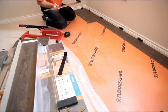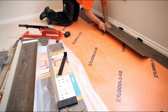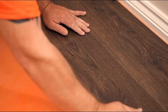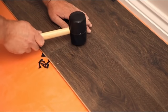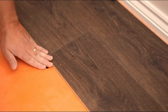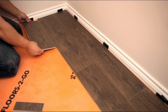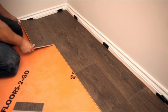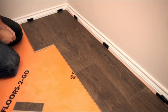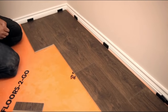Next, take a full length piece and put it at an angle into the corner between rows one and two. Push down until it's laying flat, and then with a rubber mallet, secure the two ends. For the third row, cut the board to a third of the length of a full board to give you nice staggered joints. Keep working from left to right, staggering the joints in thirds as you go. If you save your offcuts, these can come in handy for this.